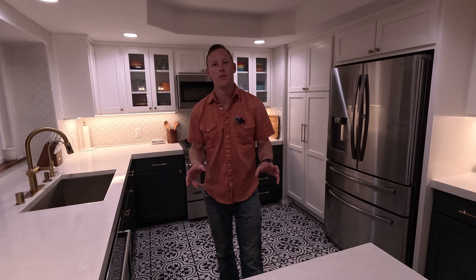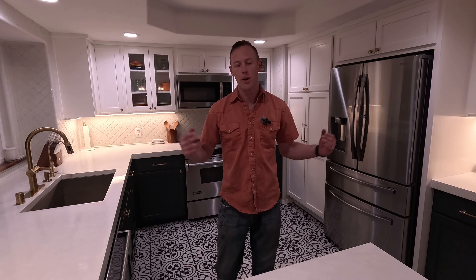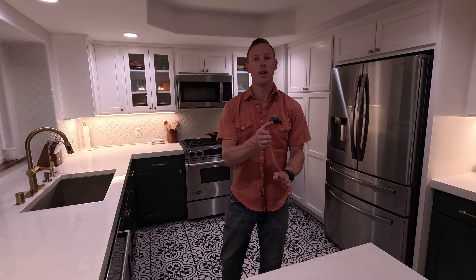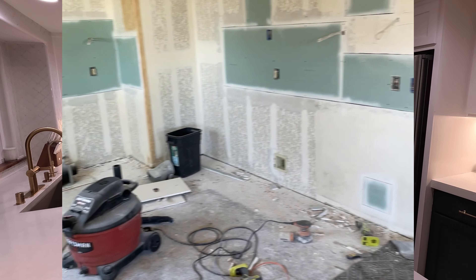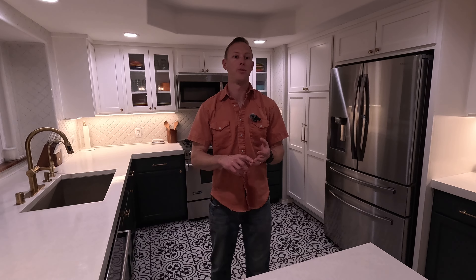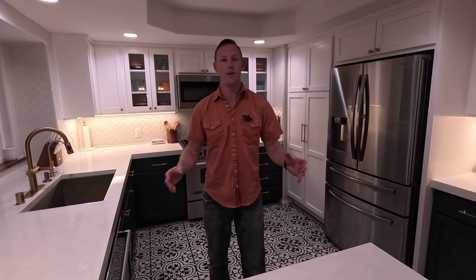There's no downtime in between. So the example of a good decision point would be when your drywall is off and you have your electrician and plumber in here, or you're almost finished with your electrical and your plumbing — make sure to call in the next step, which would be drywall. A few days before that, make sure you get the ball rolling on getting all the drywall stuff here: all your screws, your mud, your tape — everything's here, ready to go. That way, when you wanna get started, you can start jamming away at that drywall.